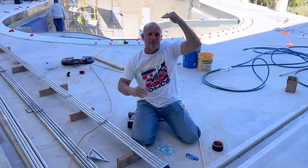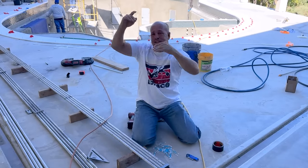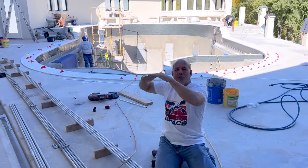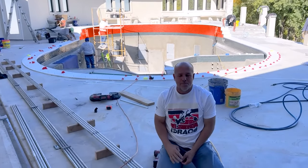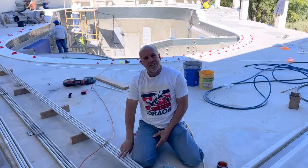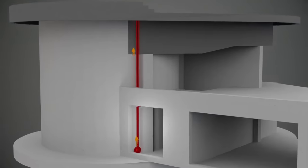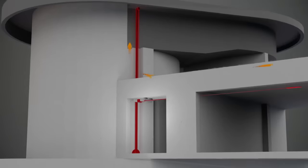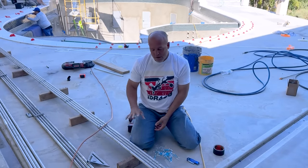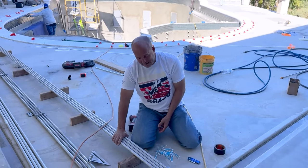So these pipes continue several feet past that. On the upper layer level, you can see in the background where it goes up several more feet. That was part of the design to get the cables out of the water line. They'll come through this set of stainless steel, go over four pulleys, across over four more pulleys, turn back down another set of tubes that goes all the way back down into the basement where the controls that operate the moving platform are. So this had to be stainless steel.